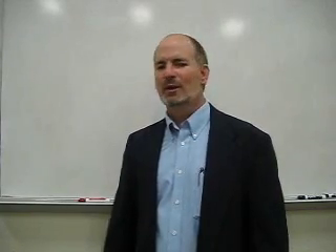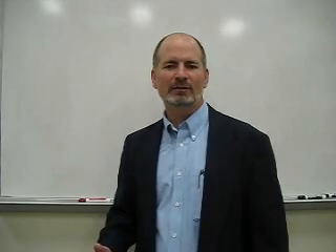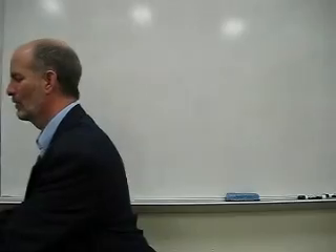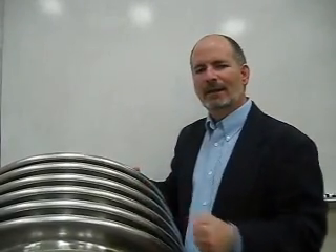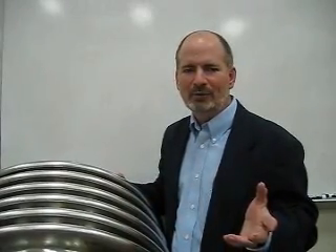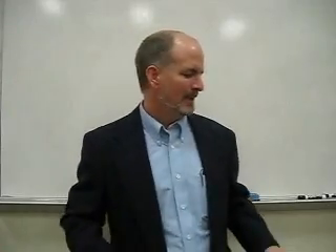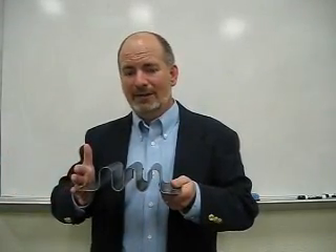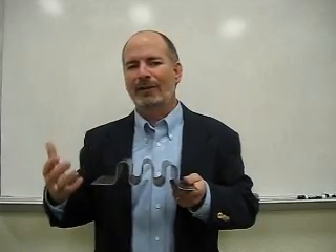Hi, I'm Greg Perkins with Oak Ridge Bellows and today we're talking about why an expansion joint works, and specifically how does it handle pressure? How does such a thin member like a bellows — and it is a thin member, let's look at one — this is thin compared to a comparative piece of pipe. How does such a thin member get even close to being able to handle the types of pressure that a much thicker pipe would be able to handle? It's all about being able to get lots of material crammed within a certain length and be able to increase our cross-sectional area.